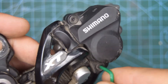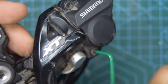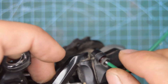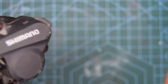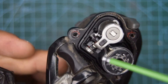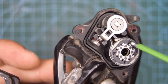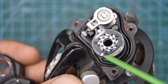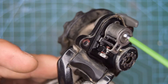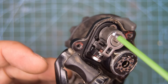Let's remove this plastic cap that gives you access to the clutch mechanism. We're removing this using a number 2 hex key wrench. One of the key differences with the newer models is the access to the adjustment screw for the clutch — on the newer models you can access it from the outside, whereas here you had to actually remove the cover to adjust it, although you can still do that. The parts here are just a tiny bit smaller on the newer versions, probably for weight savings.